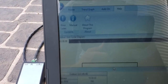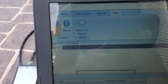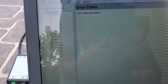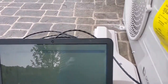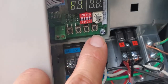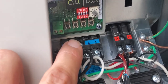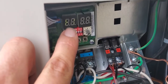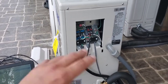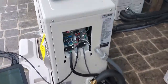I can actually show you — I'll scroll over here and hit error codes and it brings the error codes up. Look at that: E101 up to upwards of E900. So I'm able to check and see what each error code means. Now I'm using my K switch. I've got K1, K2, K3, and K4. I've got my dial set to one — I've got one indoor unit. I push K1, it shows me this and it's going through test mode. The unit goes to a test mode and displays an error code if it has an error.